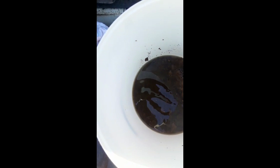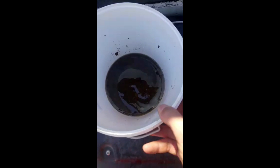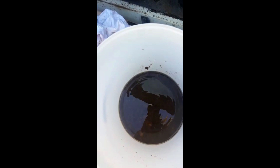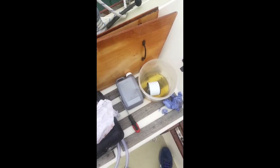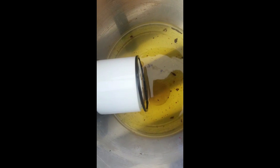So this is the last lot - two buckets of the stuff. This one's a little more watered down but there are still some big old chunks in there. That was what we could feel on the dipstick hitting this stuff at the bottom - so every time you heeled over or went over a bump, this was going into your fuel lines. I've done a few diesel rinses now; I'm going to try a bit of petrol and thinners to get it nice and clean. These chunks were sat right on the surface of the filter, so the filter itself would be in an absolute state - that would be your issue. You should have full confidence now.